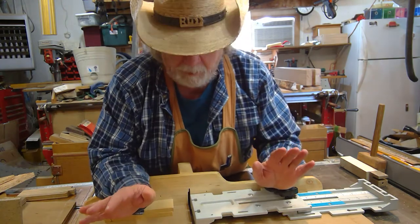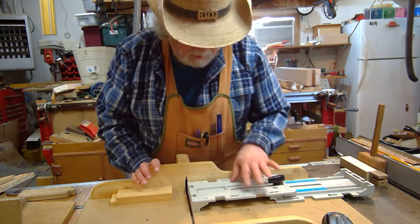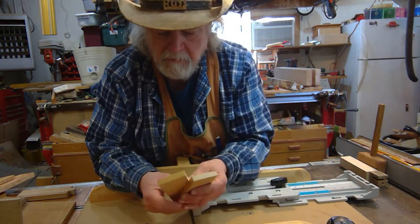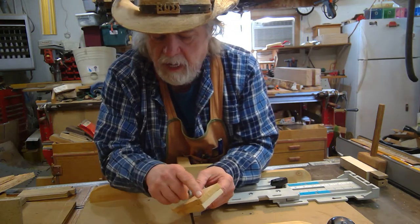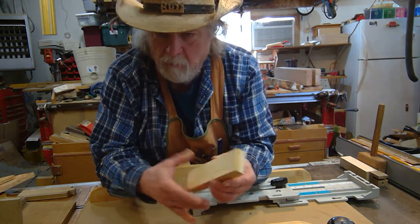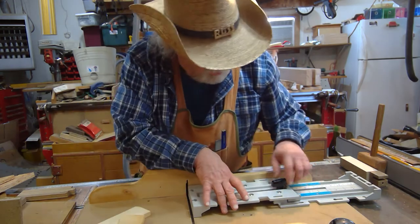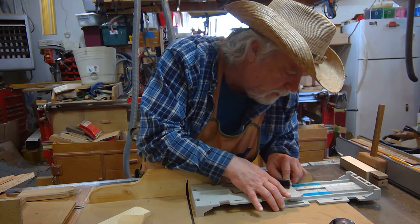To make the joint is really simple. I have my quarter-inch dado stack, like I always do in my table saw, and I mounted my incra jig right here and zeroed it out to the left-hand side. We're going to cut fingers on these two boards — they're two inches wide, just a hair over probably. So let's make a half-inch finger on each side, and the center will be about an inch. It's the outside finger dimensions that determine everything to be the right size. So we started at zero, and now we're going to want to take a half-inch off, so let's bring this back one quarter of an inch, set it, and lock it down.